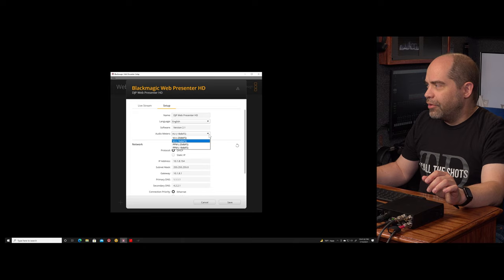The name of the device is in the upper left-hand corner — so if you have multiple units you'd give each a unique name and tell at a glance which you're working with. Below that there's a big indicator showing the status of the stream. In this case the stream is off and has been running for zero minutes and zero seconds. If I press the on-air button it will try to stream — you'll see it flashing red indicating it's trying to start. Once it goes live that will go to a solid bright red. When you hit off, it returns to the off state and shows you how long it was live.